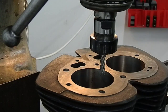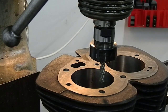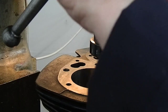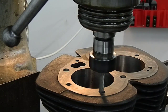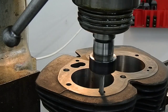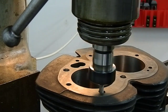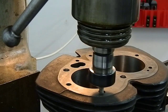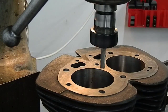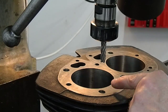Tapping drill size for 3/8ths cycle is 8.4mm. I'm going to just go through with an 8mm first to try and clear up the hole and make sure we don't wander off - if I've got sufficient hole to guide us. Just kissing the thread there, just taking the old thread out. The advantage of an end mill is it's short, it's rigid, so it's always going to cut its own path rather than follow an existing hole, which we don't want wandering off sideways.